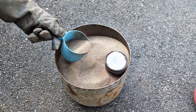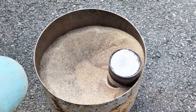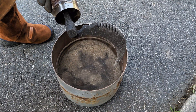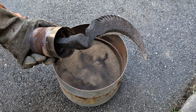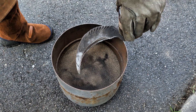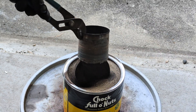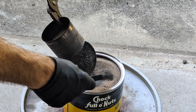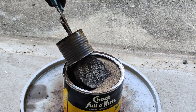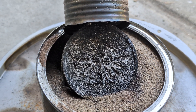Normally I either pull out the cast from the sand or dump out the container, but in this case I decided to just dig out the sand with my little scooper. At first glance I was super happy because the cast came out, but then I started noticing a couple of features I wasn't really happy about. I also removed another casting — a Zelda coin I had left over from a few weeks back. I did not coat it with drywall mud, and you can really tell because the finish is horrible.